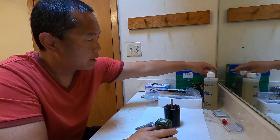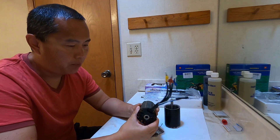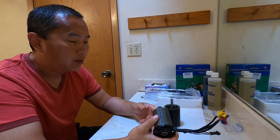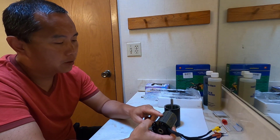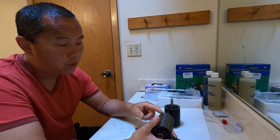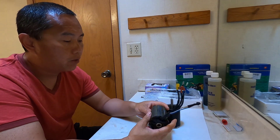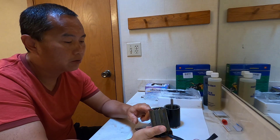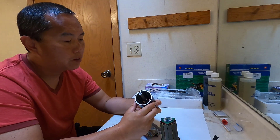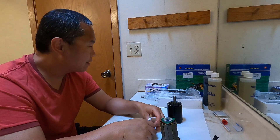Then I'm going to put epoxy to cover everything. The brushless motor is already basically waterproof — you can directly use it in water, no problem. But you want to put epoxy to block everything, otherwise the dirt will get trapped inside and eventually affect your motor. So that's why we want to put epoxy to cover those wires and also cover the magnets as well, to make it more waterproof — really waterproof.